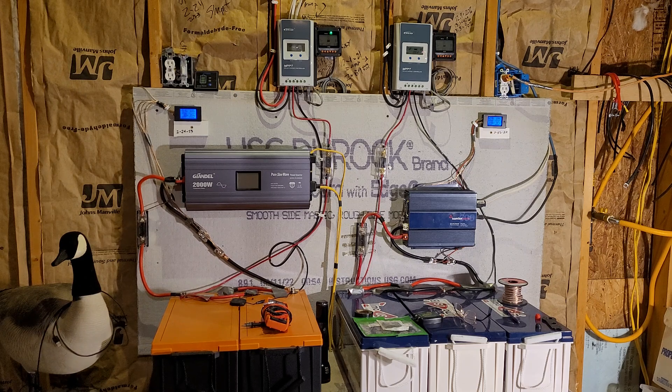Normally I don't have the excess energy to run the refrigerator, nor the battery capacity — but that's all changed with what I have now. Back to the point: 600 amp-hours worth of battery in this system lasted the eight days. That system has a constant load of about 3 to 3.5 amps, which adds up to about 80 amp-hours per day for a full 24-hour day. Eight times 80 is 640.